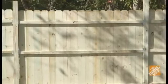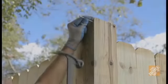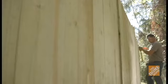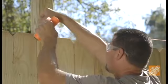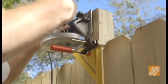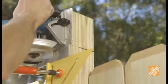When all the fence sections have been installed, it's time to set the posts. Set the end posts and any gate posts in concrete. When installing a fence with high wind resistance, the line posts should be set in concrete as well. Once the concrete is hardened, mark one end post to the desired height using a nail. Tie a mason's line around the nail and stretch the line taut to the other end post and level the line. If you're installing a long line of fence, work on no more than three or four posts at a time, as stretching it farther can cause sagging. Mark each post where the line hits it, then trim each post to this height using a circular saw. Clamp a carpenter's square to each post to guide your saw. Most circular saws won't cut through a 4x4 post in one pass, so clamp the square to the other side to complete the cut.